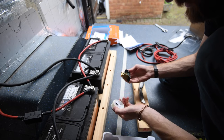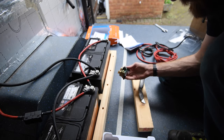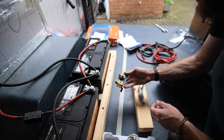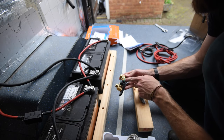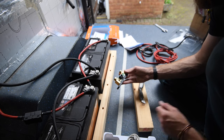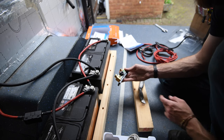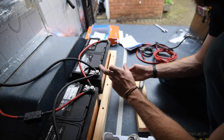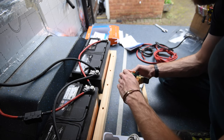There isn't actually much we need to do. The unit gets its power through the data cable, and the shunt is on the negative end. We just have to run a small positive wire to the positive of the battery and that's it powered on. I just need to make a short cable to go between the negative terminal and here, then re-bolt the other connection on the end.